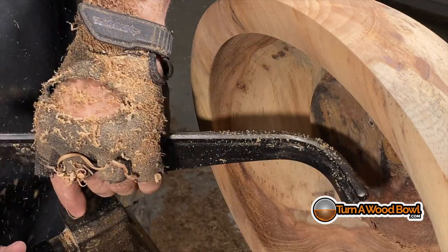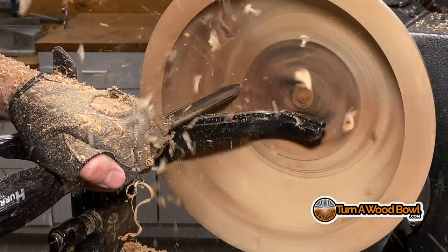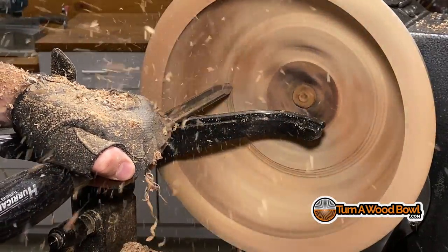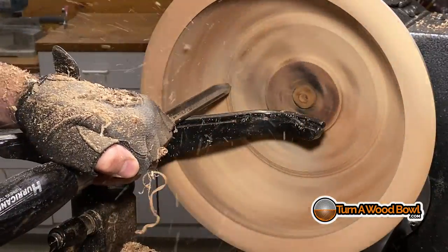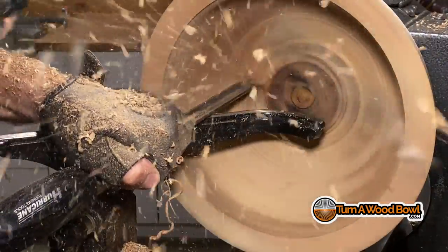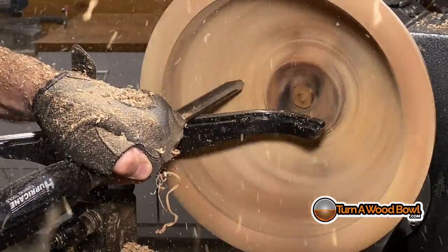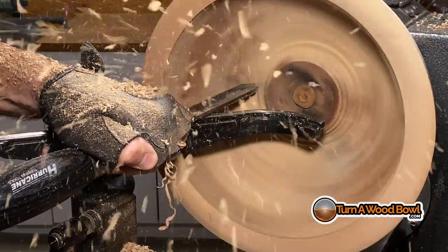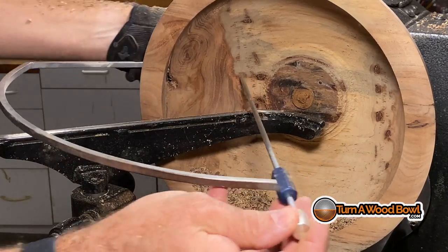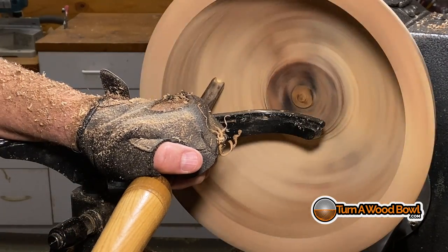I've tilted the round nose scraper just a bit so that it's just scraping and won't create a catch. This is a half-inch bowl gouge and I'm going to start removing the material down into the bottom of this bowl. At the 55-degree bevel angle, the shaft of the flute is almost touching the rim of the bowl. If the rim is interfering with the bevel, then I'm most likely not riding the bevel, and if I'm not riding the bevel then I'm scraping and I'm going to make tool marks. I want to be able to ride the bevel all the way to the bottom of the bowl. The way to do that, if you can't get there with the bowl gouge you're using, is to use a micro bevel — some people call that a bottom feeder because it's designed to go into the bottom of the bowl. I'll put a link to all the tools I'm using in the description for this video.